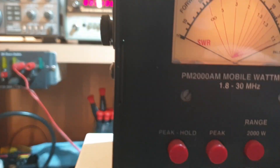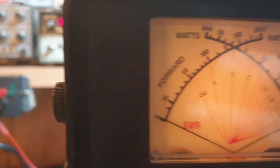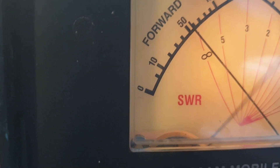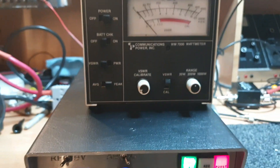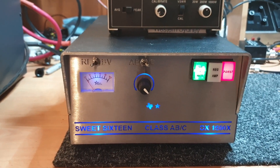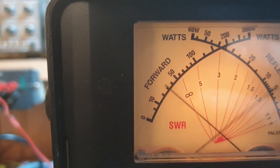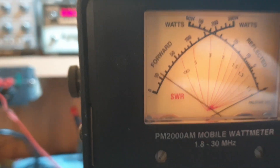Let's just go to sideband and go to peak power there. Let's just have a little look — hello. So about 700 watts peak I'm getting out of that at the moment. You'll hear lots of classic reports of these putting out 2,000 watts and lots of things like that. And there is a difference between class AB and class C — I'm just trying to remember what that is actually. This might be easier to show you.